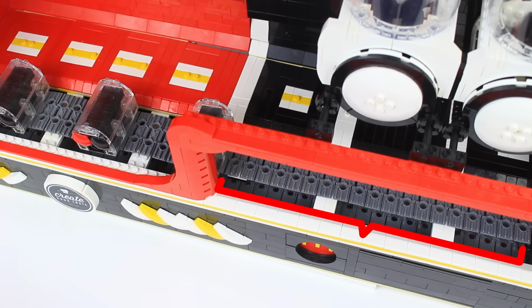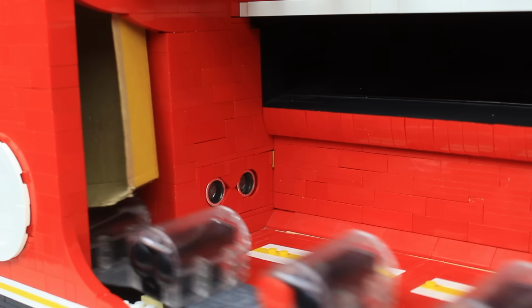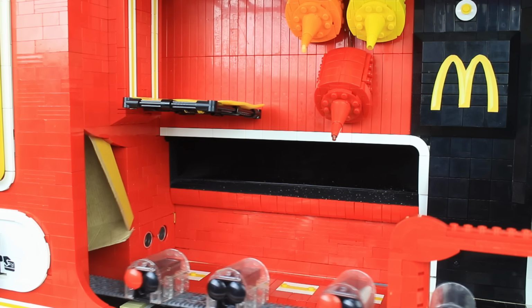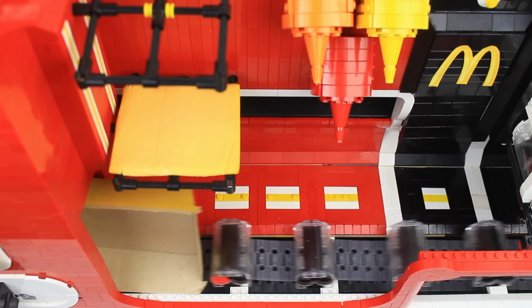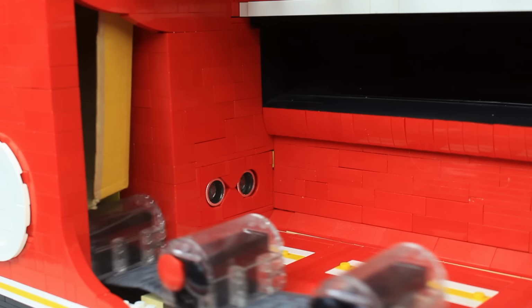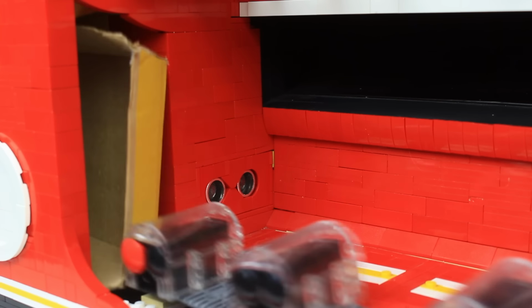First, the conveyor belt turns clockwise until this pocket reaches the stack of empty boxes, where it does this little shimmy to ensure the bottom box is sitting flat. Otherwise, something like this would happen all the time. It then comes out from its hiding place to land open side up on the assembly line, then positioning itself just right according to this distance sensor.